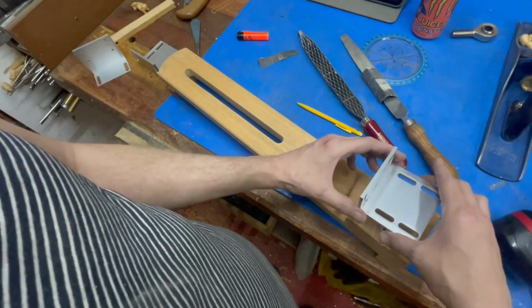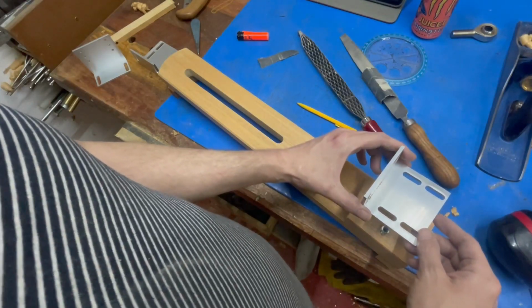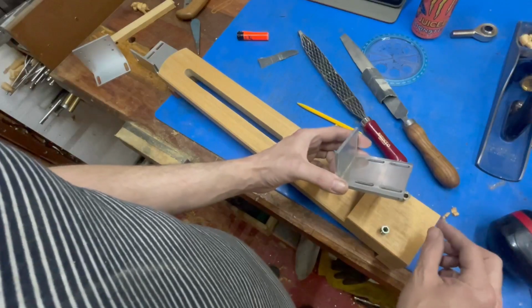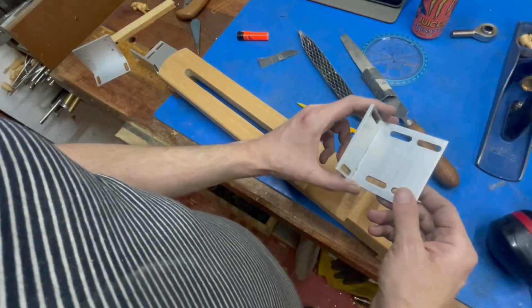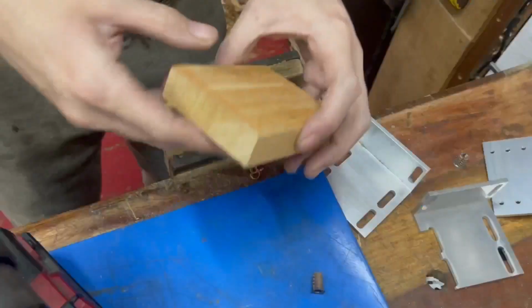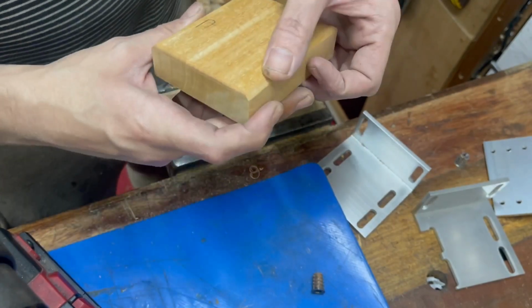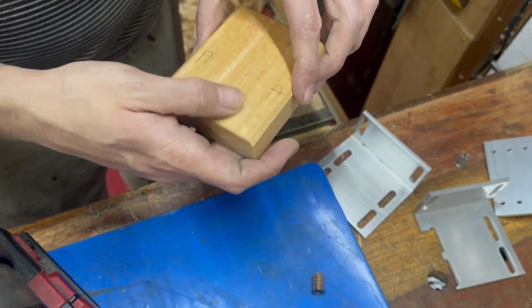And with a bit of wood here, it will pivot it. Blade here, and that will squeeze it and hold it on tight. Bit of leather here, leather there to protect the blade. And that'll be us, basically finished. So I chamfered these sides, and then I just put a round over on this bit here where the blade's gonna sit.